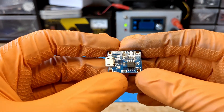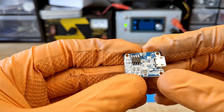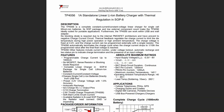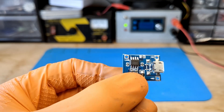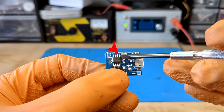The TP4056 is the brain and heart of the modules we use so much. I have talked about it extensively in the past. According to the datasheet, the TP4056 has a pin called Temp — usually pin 1 of the chip — that is used to monitor battery temperature via an NTC thermistor. If the temperature is too low or too high, the chip stops charging. This function is not used in these modules, so the temp pin is directly connected to ground.